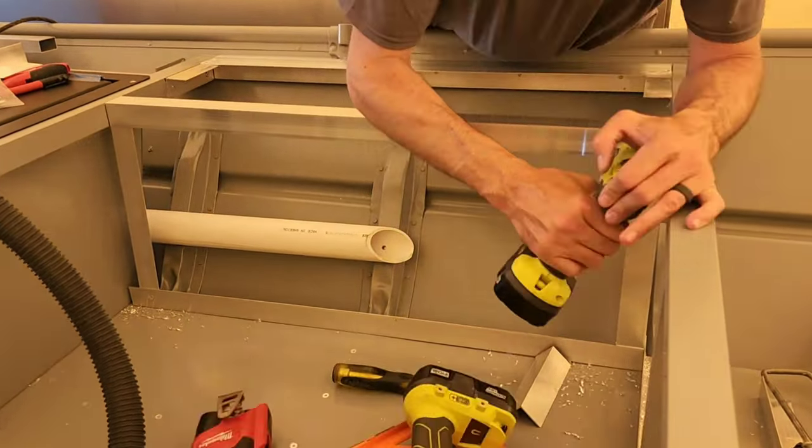If you guys remember, Cary had the boat painted gloss gray before dropping it off with me, and months prior to the boat getting this wrap job. He wanted a smooth gloss finish to wrap over, but also needed the paint to cure properly before applying the vinyl wrap. It's recommended that anything that's painted cures for at least 30 days before wrapping over it, and this is because the chemical makeup of the paint will continue to change during the curing process, sometimes shrinking or expanding, and solvents even evaporating from the paint. Long story short, don't wrap your boat or anything else directly after paint if you want long-lasting results without peeling, wrinkling, or discoloration within the vinyl.